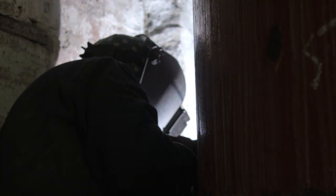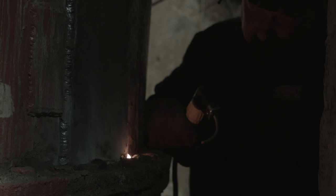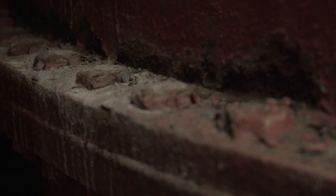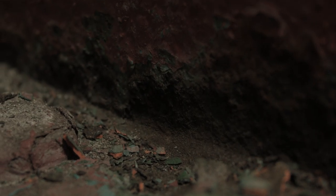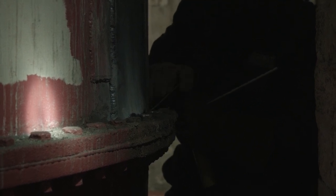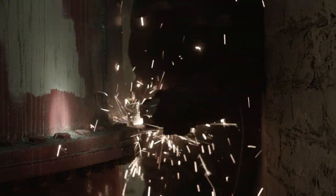Well, the problems with the filters were there was various areas which produced holes, purely and simply because of the age of the filter, it rusting, and with it being a sand-filled filter, with the sand rubbing against the actual parent metal. Well, the repairs on the body, on the shell of the filter, on three areas, and one underneath, which is the inlet pipe, where it was very difficult to repair because of the space between the actual dished end of the filter to the floor.